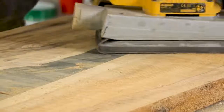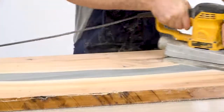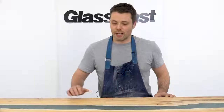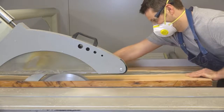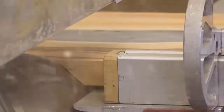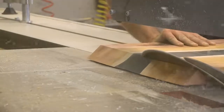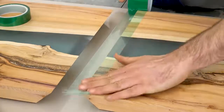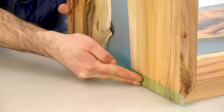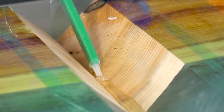We'll use an orbital sander to make light work of finishing this top face, starting with a coarse 80 grit pad and then working through the grits up to 1200. Apart from the polishing I'm happy now with the surface of this top so I'm going to take it over to the saw room where I can tidy up the edges and do the cuts for the mitered legs. To bring these leg sections together with our top we're going to use a special clear epoxy adhesive. The flash tape is also perfect for this job because it's very strong and the resin won't stick to it, so it makes the perfect hinge for our mitered corner. This Permabond ET500 is a perfectly clear epoxy adhesive and is incredibly strong, so it's ideal for creating a glass-like mitered corner.